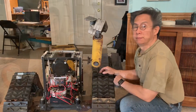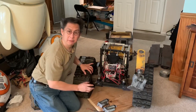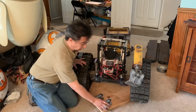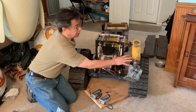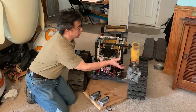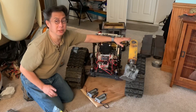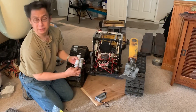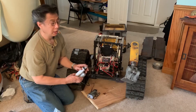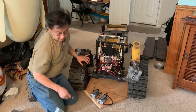It's really just holding on by friction. I'm using an actuator to move this arm up and down. The arm is kind of heavy, and you can have two different models that look exactly the same — one is 50 pounds and one is 150 pounds of force. A 50-pound actuator in this setup is pushing the entire arm, and the outside hand gets kind of heavy, so you're pushing quite a bit of force. With a 50-pound actuator you'll really hear that motor strain, but it moves faster than a 150-pound actuator. The 150-pound actuator has different gearing, so the piston comes up slower. I want to use a 50-pound actuator, and the only way to do that is to put a torsion spring in there.